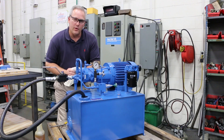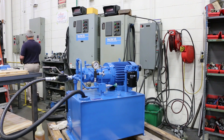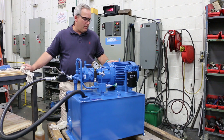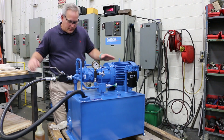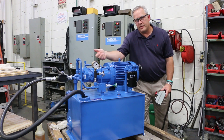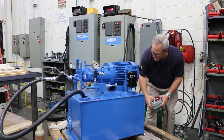The first thing I'm going to do is turn on the power. This motor is a 5 horsepower, it's actually run on 460 volts, 50 hertz, which is not our standard. So I'm going to watch my ammeter to make sure I don't over-amp the motor. But I'm going to go ahead and start it up and check our rotation. Rotation should be on the side of the pump right here — right-hand rotation means where your right hand facing the pump shaft is going that direction. So always check that.